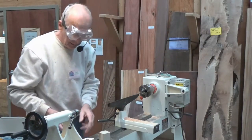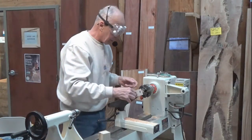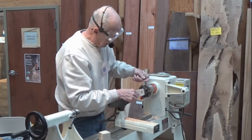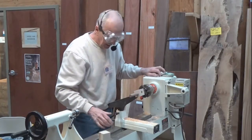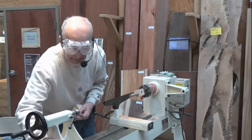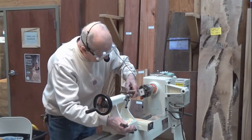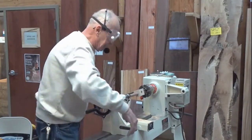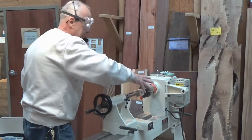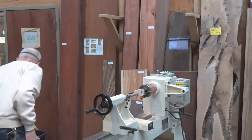Let it dry. And then what you do is you glue everything in here. The same thing. You put it in your chuck, tighten it down, sort of. You bring up your tailstock into the center that you've done and center it. And that's how I would glue it, just for about 3 minutes, so I know it's all in the same plane. Because it's important here again.